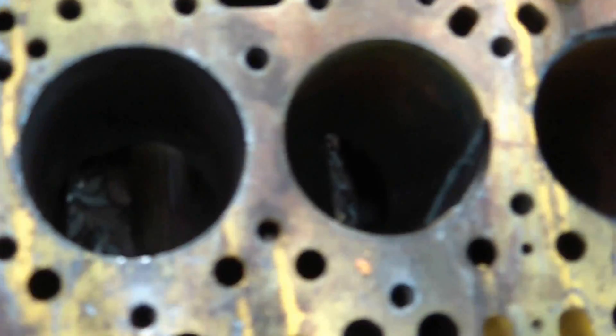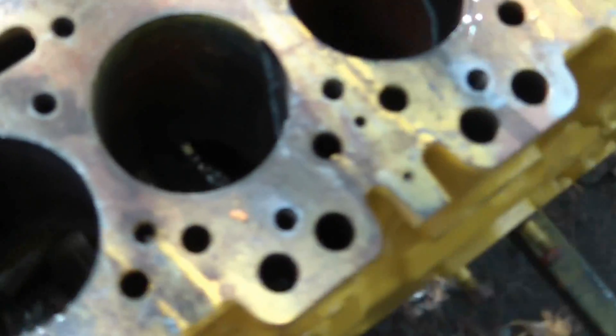So what I'm going to do is show you the process I'm going through right now. And that is the plate that I actually made to fit inside the block to push against the liner with a hydraulic jack. I had 5,000 pounds of pressure against it when it let go — it didn't feel too funny.